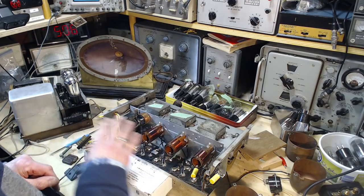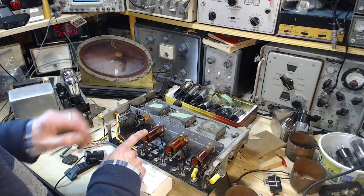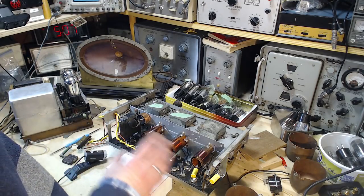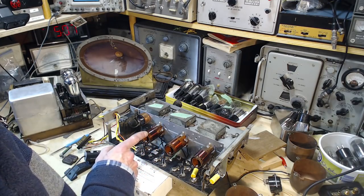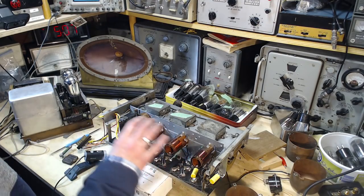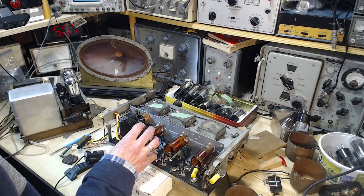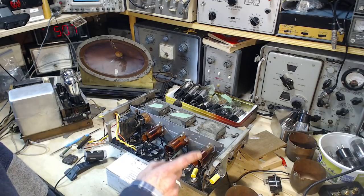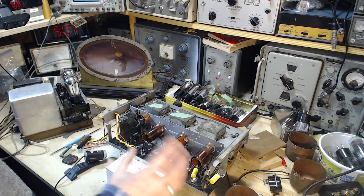So this guy's different. This whole radio, right up until the detector, is running at the received RF frequency. So inside each of these coils is whatever you've tuned the radio to. So let's say it's a megahertz. Okay, fine. So we're tuning in around a megahertz in the AM band. Each of these coils now is resonant, the last coil having a fair bit of signal in it. So without these copper covers on here, the last coil with its powerful built-up signal strength can simply feed that right back to these other coils, especially the first one. I may have these backwards here. No, I think this is the first one. Because they're sensitive and they're resonant at the same frequency that the strong one is resonating at, unlike a superhet set.